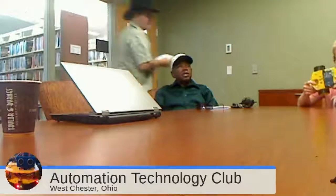The LEDs do suffer a little bit because when the ultrasonic turns, it has to put the ultrasonic into a small loop to update the turn, so the LEDs lose out. How long is that? A millisecond or something? 500 milliseconds is what I've got it set. That's a long time. Yeah, so the LEDs do lose out a little bit, and I probably could change that so that it's updating both at the same time.